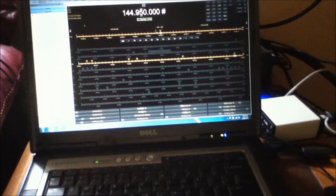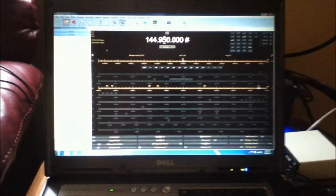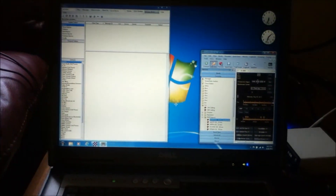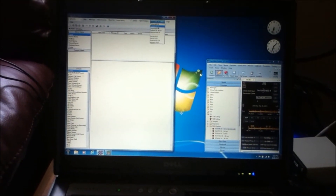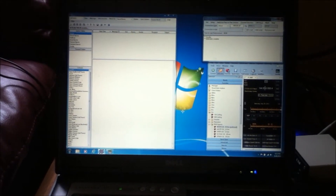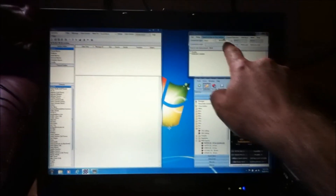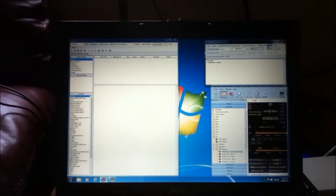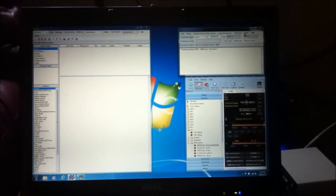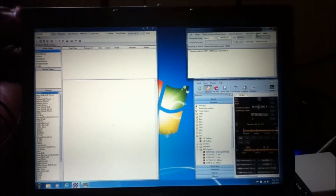This next station is 42 kilometers away on 144.950 megahertz. I'm going to change over to packet and receive that signal back. I've already selected my station and channel. I'm going to go ahead and start — it's much faster on VHF, you can hear it already.